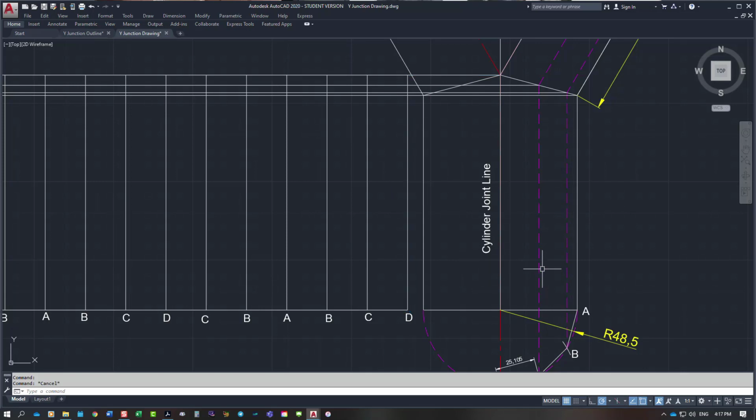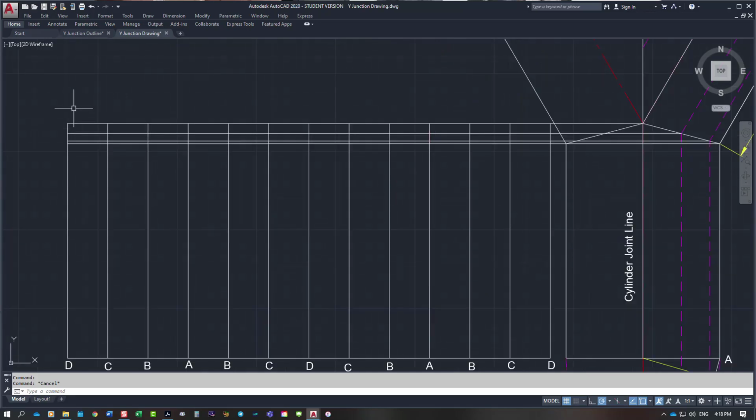If I was looking at line C, this would be line C going across here, and I look for the C's. All the C's will have that elevational height, so I would have a point at that intersection point there. I'd have one there, I'd have one there, and there's another C further out that I would have as well. So what I'm trying to do is a spline. You will sketch through here with a pencil, whereas I'm drawing it in like this.